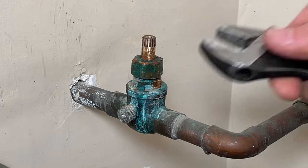I installed the new flat washer — the old one was beat up and dry, probably in place for over 60 years, well past its serviceable life. Now building this back up: one thing to note is the bonnet itself is metal-to-metal in terms of contact surface. This one doesn't have a fiber washer, so we'll see if it leaks — I may have to put Teflon cord, Teflon tape, or something to seal this metal-on-metal surface.